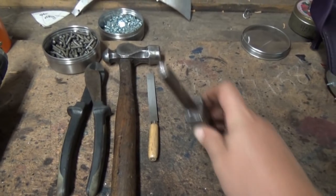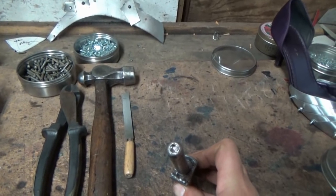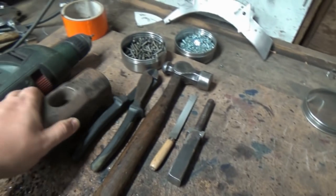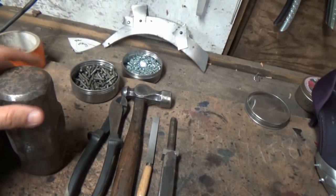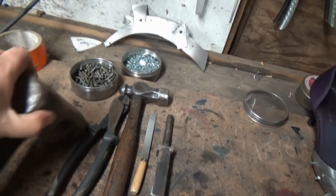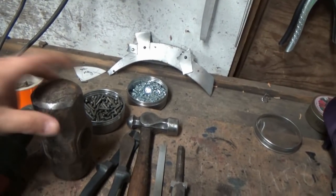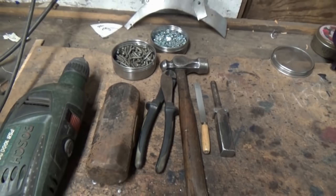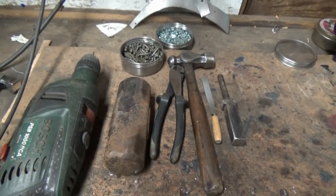The snap tool — so that the rivets don't deform on top — I think realistically if you're trying to make it look nice, you need a tool like that to rivet into, or a tool like that to set your rivet back nicely afterwards. I used an anvil earlier to do the setting on. Get down to a car boot sale and just pick up an old sledgehammer head and you're sorted. And if you're feeling up for the fight, just drill a few holes in the top, get that held in the vise, and there's your snap tool and anvil all in one. So that's probably the bare minimum tooling you'll need.